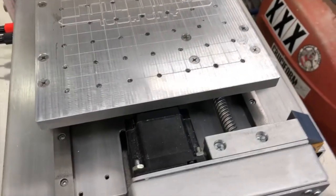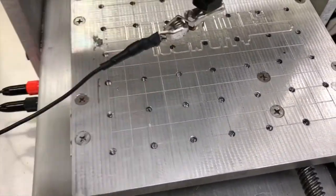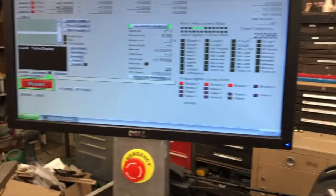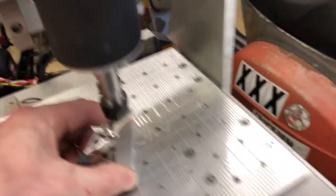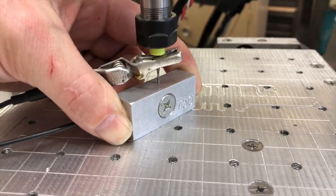To set the Z I still come up here and hit auto tool zero — I'll show you how that works right now. I've also slowed down my rapids a little, it's just easier to control. I touch here and you can see that pin is flashing, so I know everything's plugged in. The auto tool zero has a short delay programmed in, so I hold it down tight — and now you can see it is exactly one inch above the table. Good to go.